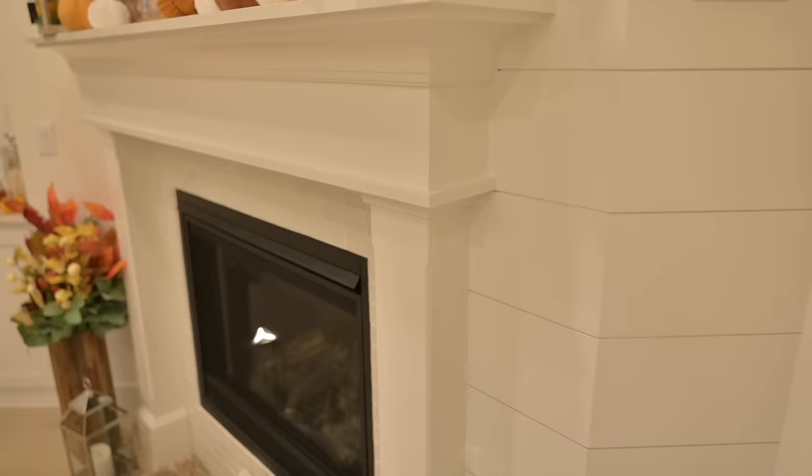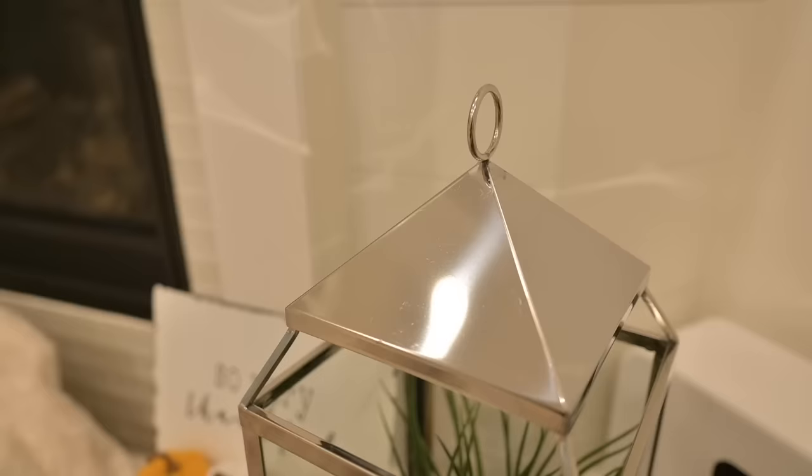It's a real classic look and I think that's why people like it. It's got some nice powerful trim work on it, but it's not overkill. And I see that as kind of the trend today. A lot of people don't want just a ton of trim, but they do want some shadow lines. They do want some really cool millwork. Like you can see, I chamfered the legs here and they stop before it gets to that little cove up under there. And that just gives it another shadow line, just some definition.